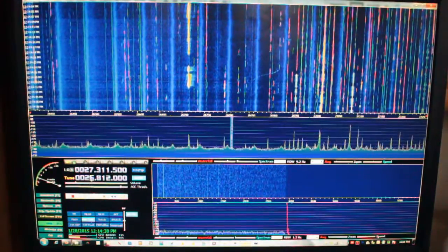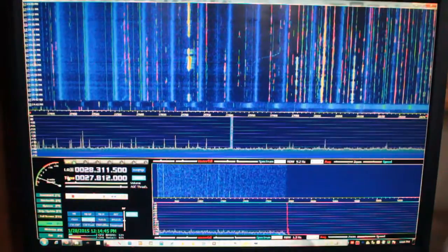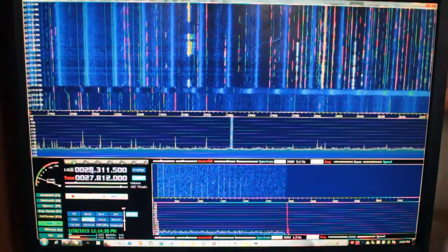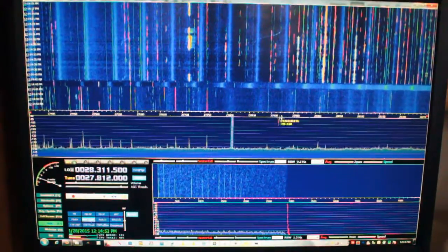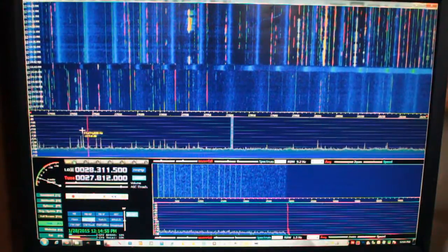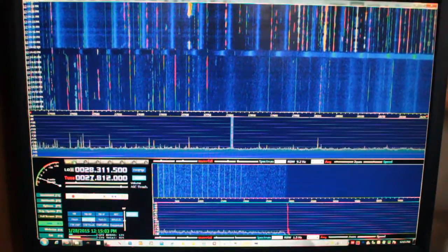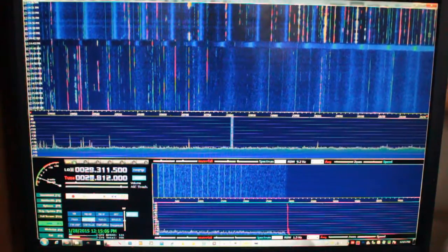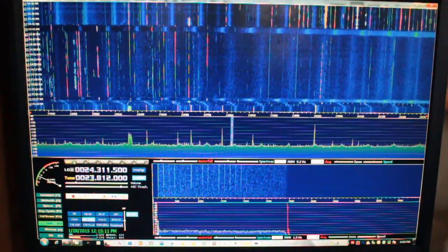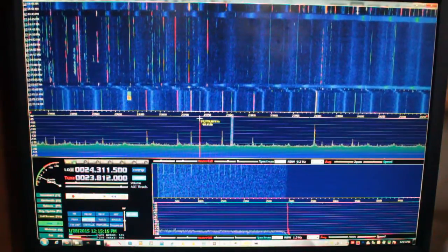Let me take you on a very quick tour. Notice the tune frequency — don't pay attention to this one, that's the local oscillator frequency. I run with an offset to get the center tuning spike out of my way. It interferes. If you've got them both lined up, you'll get heterodyne and it'll make you crazy, and it will also suppress weak signals. So I run with a 50,000 cycle — sorry, 50,000 hertz — offset.